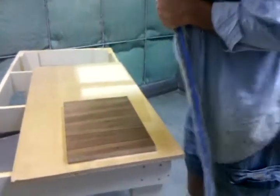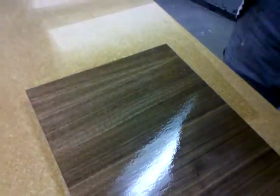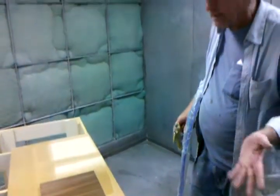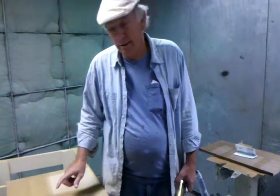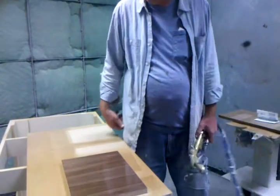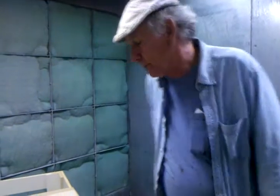What are your thoughts about this particular acrylic lacquer? I like this lacquer. The first thing I want to say is it sprays nicely — it doesn't have any orange peel. What I really like about it is very little odor. And the fact is that it's superior to any of the solvent-based 275 lacquer you're going to find in LA or Orange County — that would be the Pre-Cat. This is much superior to the Pre-Cat. It's much harder and it's got a terrific look. It's crystal clear.